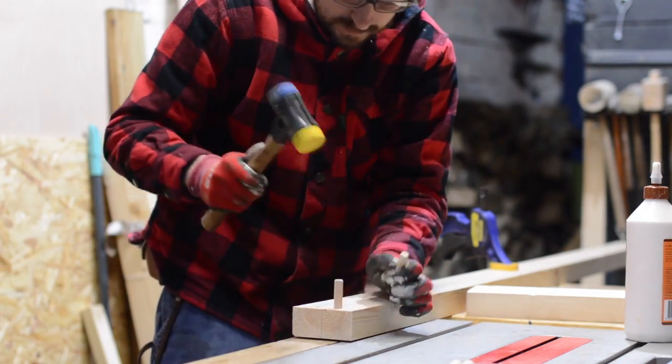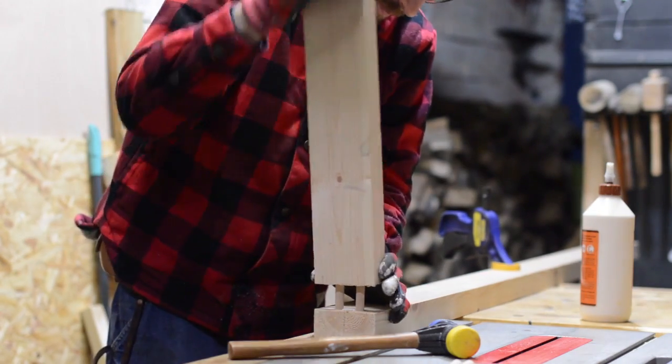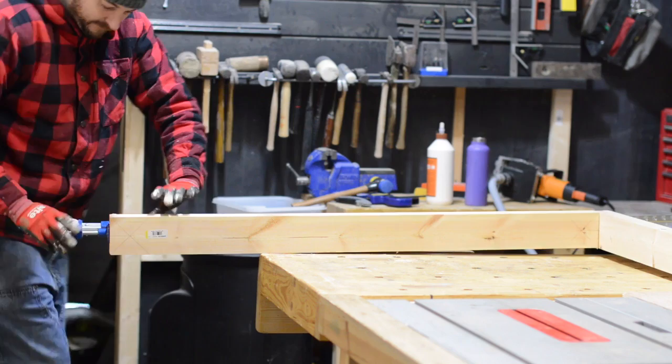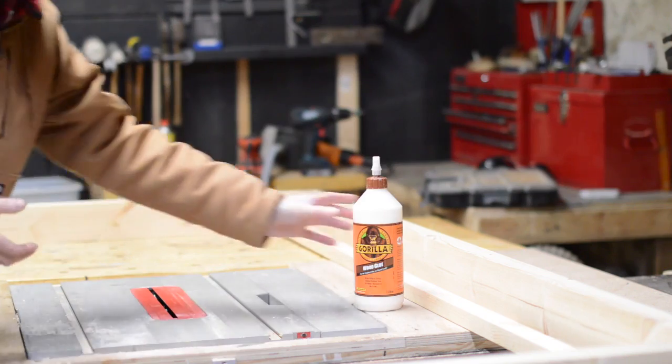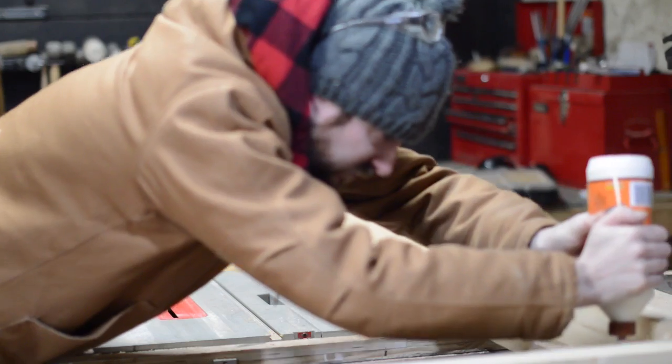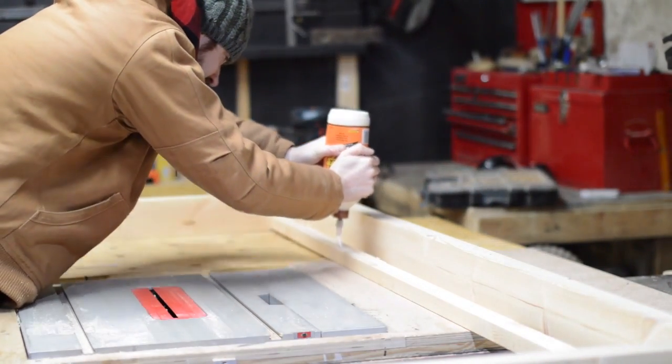So with 2 pieces cut as wide as the slats, and 1 piece as long as the hut, I could join those 3 together to make a U-shaped piece of wood. This is all going to go on the back wall and the side walls and make the frame for the bed. I cut down some square timber, and then this gets glued and screwed in place, and this is going to be the support for the slats to sit on.